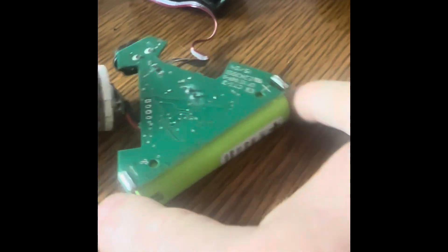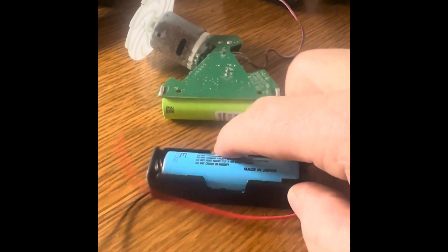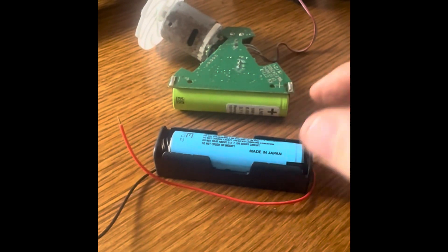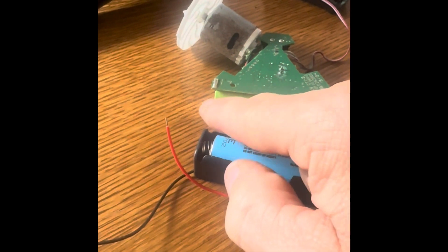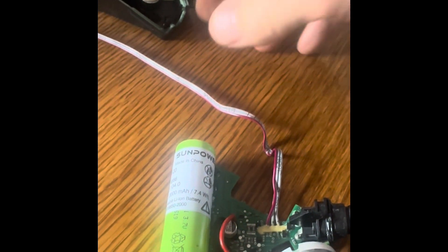Before that, I'm going to put the voltmeter across the battery to see if there's any power in it. I've got a spare battery pack here — I tested it on the voltmeter and got 4.1 volts. So what I'm going to do is put the positive to the positive and the negative to the negative on the dead battery, and see if this kicks the device back into life.